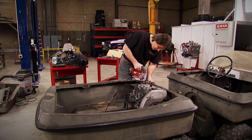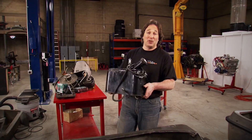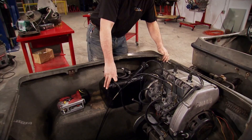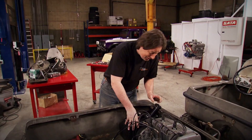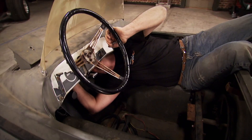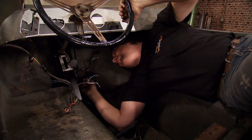For the gas tank, we really lucked out, because even though the original tank is long gone, the tank that came with the Polaris snowmobile is not only full of 1975 gasoline - which was only 35 cents a gallon - but it's also going to slide right into place with just some minor modifications right here beside the engine. That is why it is so important to get everything you can off of the donor vehicle. Obviously I'm not going to use that old rancid gas - make sure you are cleaning and purging an old tank before you reuse it. The final step is to hook up your wiring and your cables. Please do not reuse your old nasty wiring or cables or hoses. Spend a few bucks and get some new stuff, because it's cheap insurance, and you can pick it up at almost any motorcycle or ATV place.